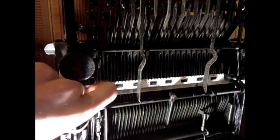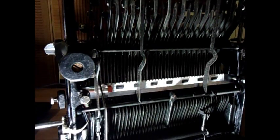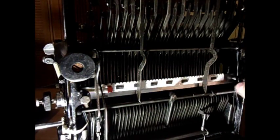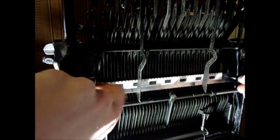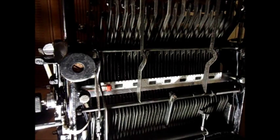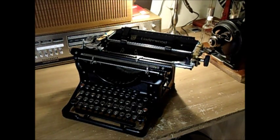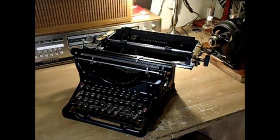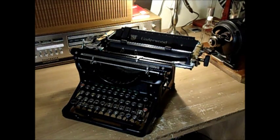Another nice feature is that you can deactivate the entire linkage by just screwing these two bolts down — now the keys aren't touching again. So if you don't want it digital for typing something like a letter where you don't need a digital copy, just screw these bolts out, and when you need it again, screw it in again. That concludes my video on how to install the USB kit on the Underwood typewriter without harming it. I hope you enjoyed it — also look at my other video where I show this thing in action and why I wanted this kit. Thanks for watching and bye-bye.